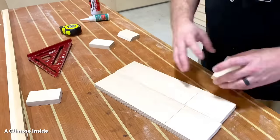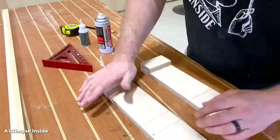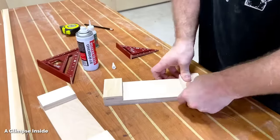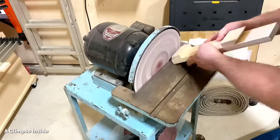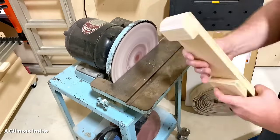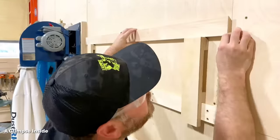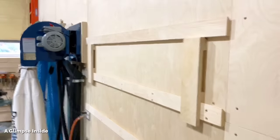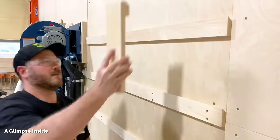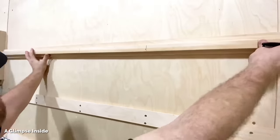If you're a fan of the channel, you know I'm familiar with French cleats and maybe you are too, but I've never hung them this way. I'm trying something different here to make this process really easy. I'm making two little supports that are equal in length and I'm going to cleat them up on the wall. There's a small cleat at the bottom, but I have to remove some of the material at the top. When each cleat is put in place they're exactly the same length. As long as your one cleat at the bottom is level, you can do this process and quickly go up the wall and everything is level and flush. The reason they're tapered at the end is so I can remove them — if you don't do that they're going to get stuck.